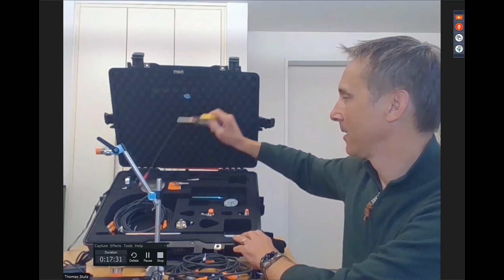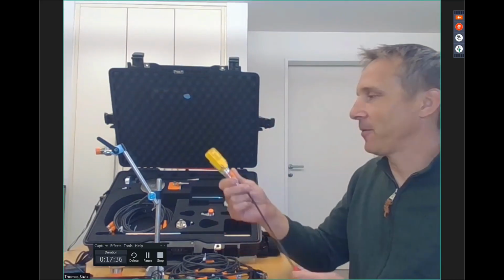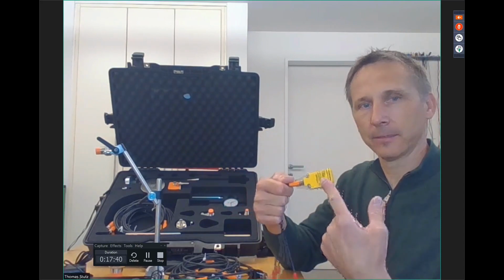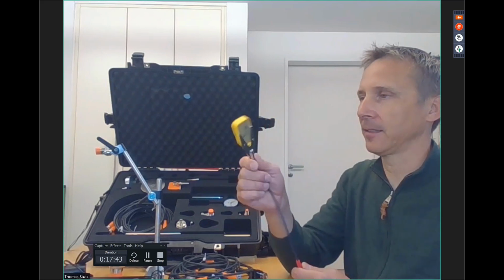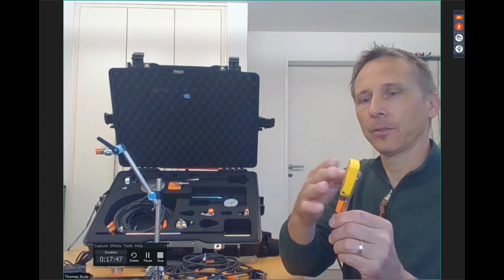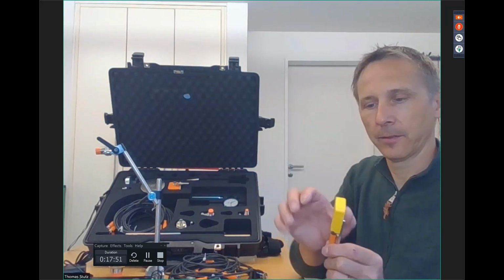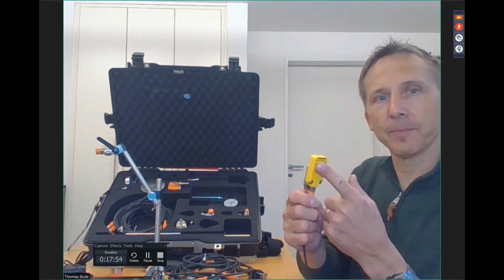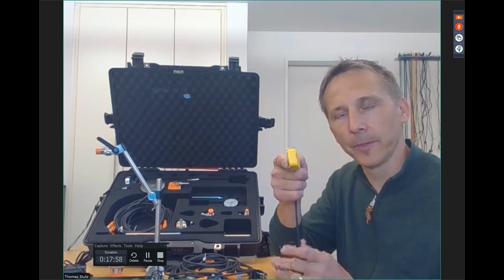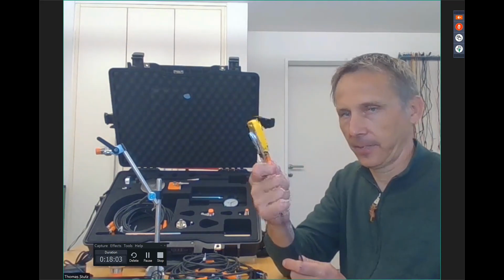Let's say you're in the field and you're not comfortable with that distance. Yes. Then we have a special one. This is a very flat one, and it measures here. So we found that as well, and we added it to the kit. With that, you can measure to the side. It's not in front, it's here to the side. So when we have a very narrow space, maybe under a cover, to the side, for the wobble of the girth gear, maybe we have only a tiny space, we can use that.